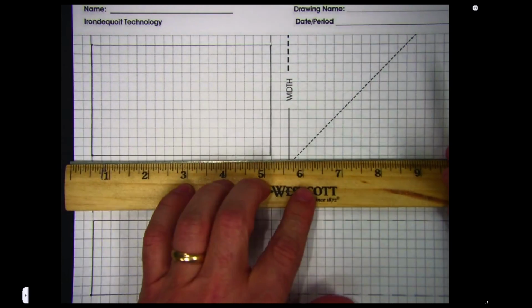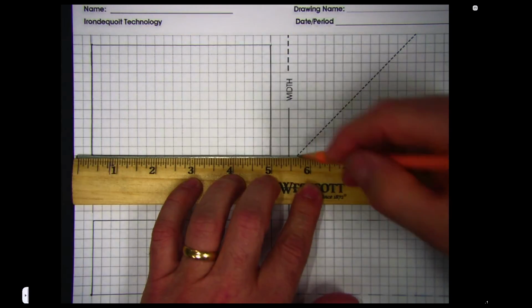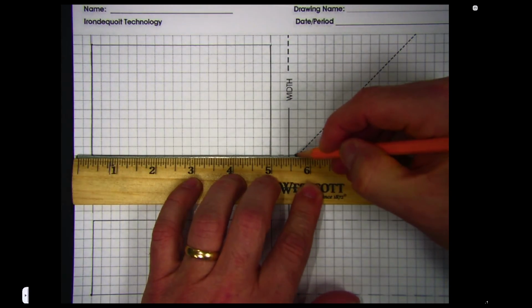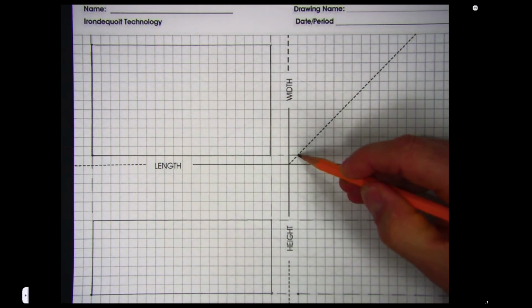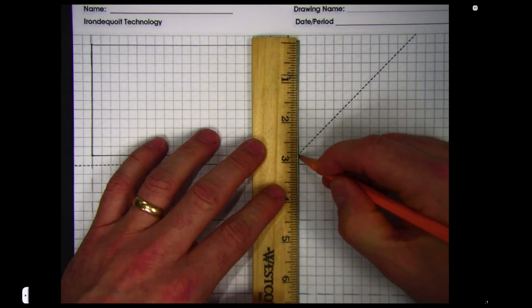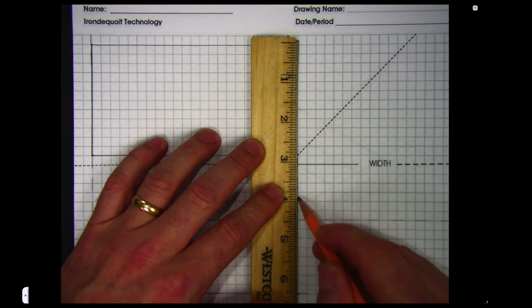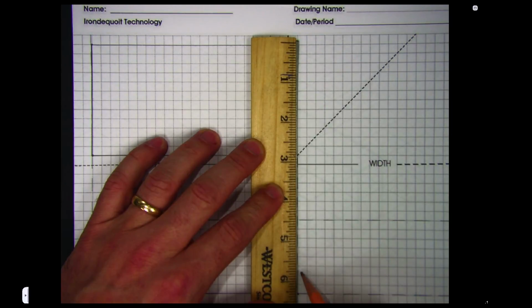At this point, I'm going to project the new information from my top view to my rebound line. So I'm coming across that intersection point. Right when I get to that 45-degree line, I'm going to go 90 degrees or down. Okay, again, I'm following the graph paper line, and I'm projecting this information to my side view. So I'm using projection lines, which I'm making here dashed lines.